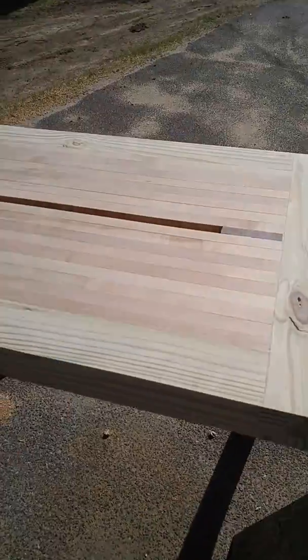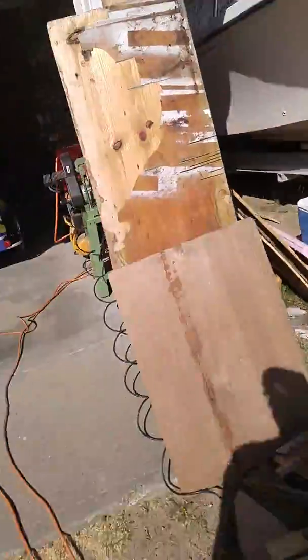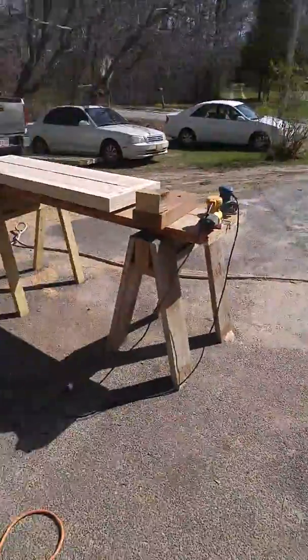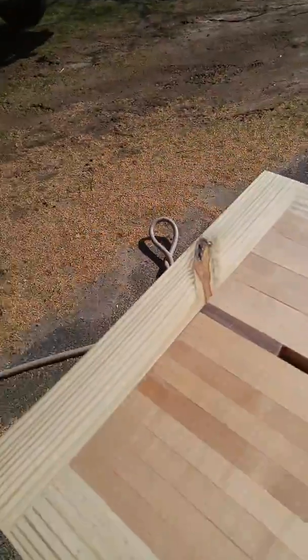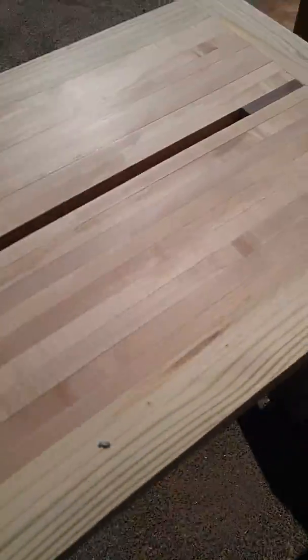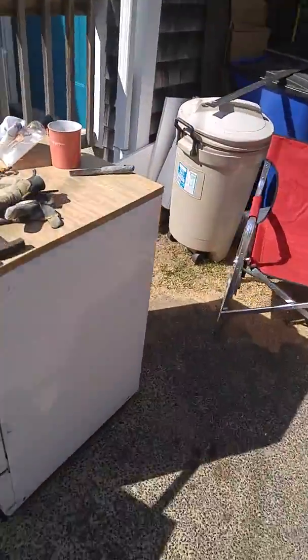And we're going to drop some oil on it here — just going to blow it off quick. So the beams of maple just weren't wide enough to make a table out of, so I decided they were the perfect size for a workbench since I needed one. It's been sanded out to 400 grit and flattened — I had to take an eighth of an inch bow out of it. I think I caused that when I clamped it up, because the gap in the middle had bowed up. I've been at it since 7 o'clock this morning. Now let's see what it looks like with some oil on it.